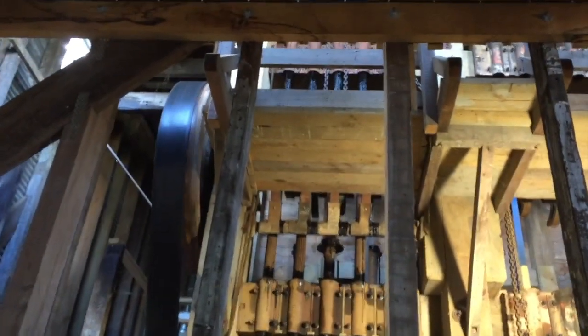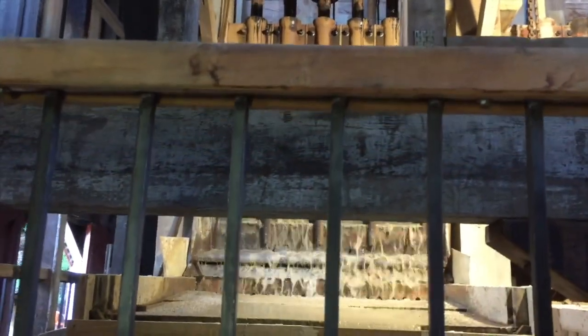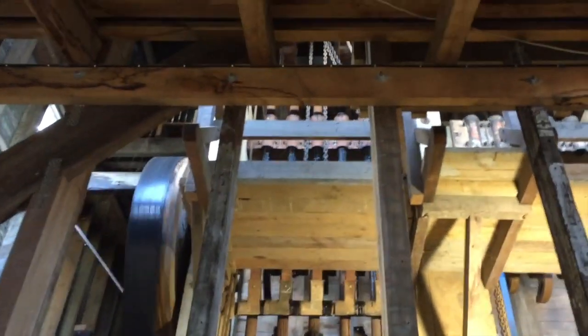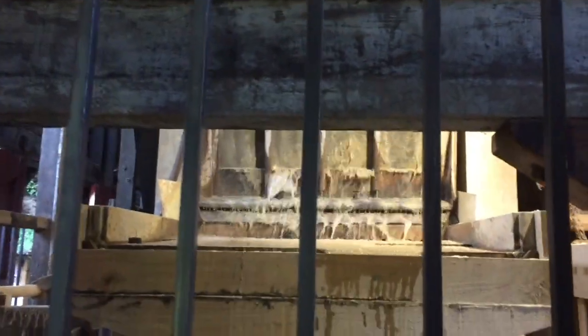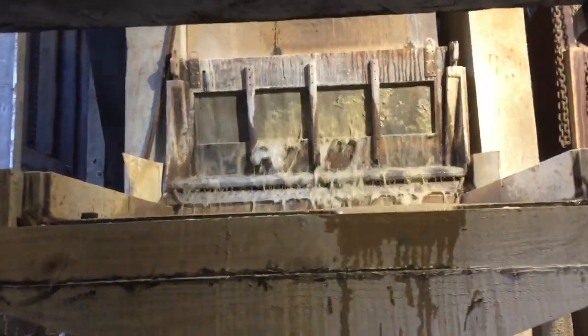The actual height the hammers drop varies depending on the position of the cam follower on its shaft. The whole plant is three storeys high and tourists are allowed on the second level, where you can see the stampers moving up and down and water coming out through the screen. The quartz comes from mines in the hills and gravity helps transport it. It goes through a jaw crusher to reduce it to the size of golf balls, then into hoppers before being fed by an ore feeder system into the mortar box where the hammers are.